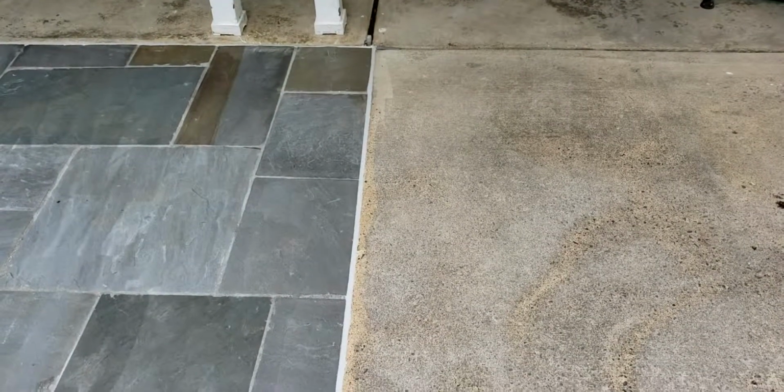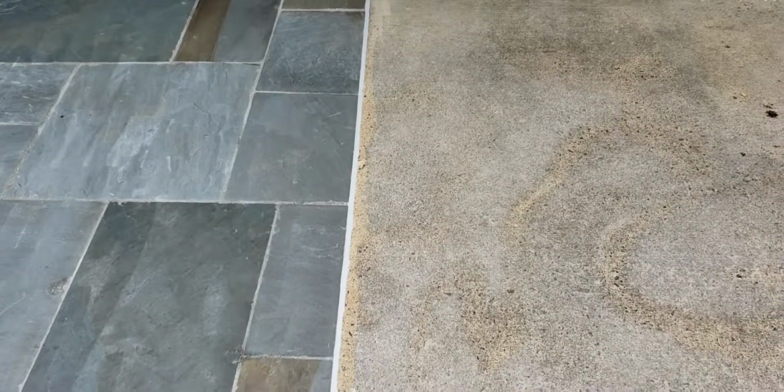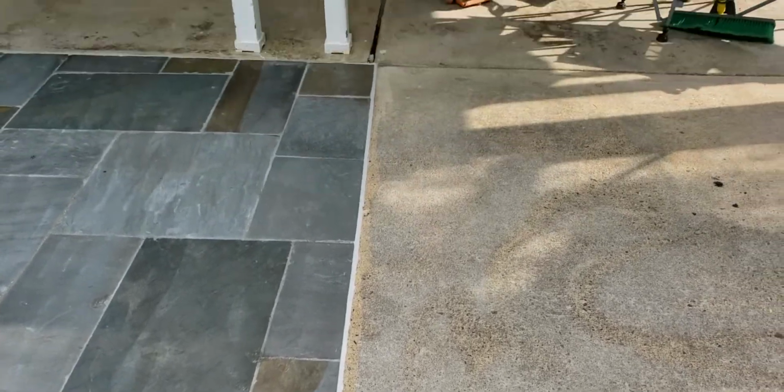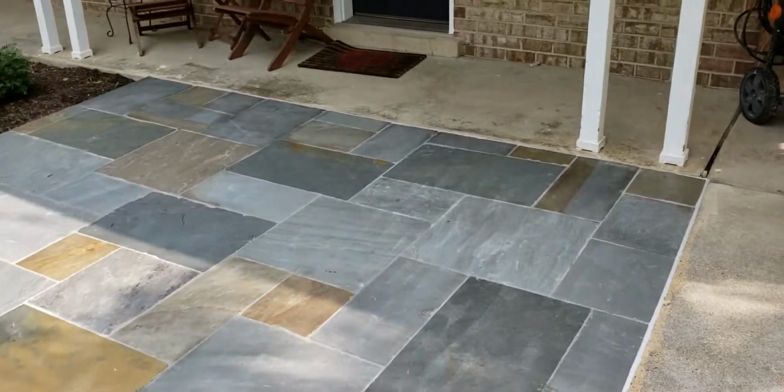One thing we just started doing this season, which is a nice added value, is instead of putting the mortar between these cold joints that are existing in our new work, where it tends to crack up after a few years, we actually came in and put a self-leveling polycaulk, which is waterproof and prevents any cracking in the future. And again, we wrap that around all the cold joints on the projects now at Tuck GC.